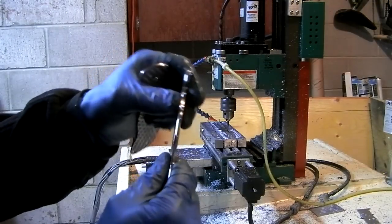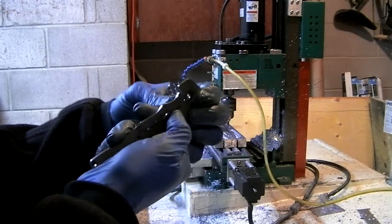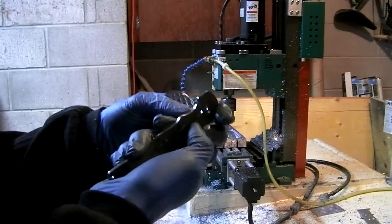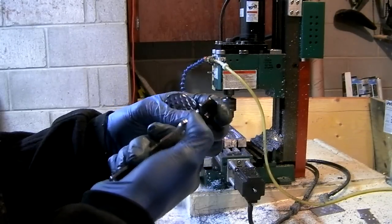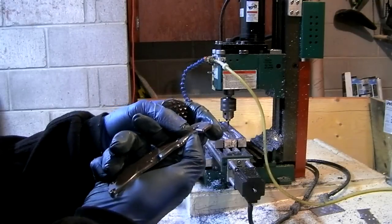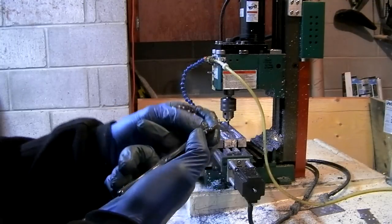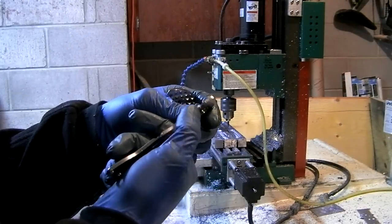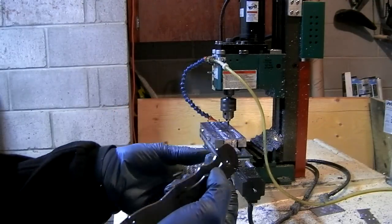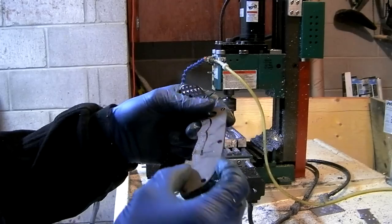It's got some spring tension to it. You don't want it too hard, but you don't want it too soft. And I'm no expert on frame locks. I've never owned one. But I'm not a fan when they're too tight, when they've got such a heavy pressure to them that you can't even disengage it easily. 42 thou might be the magic number. It depends on a lot of variables, how long the lock bar is, etc., etc. How wide it is at this point, so.